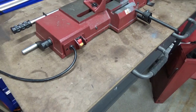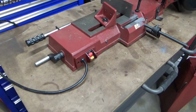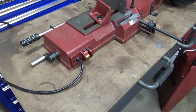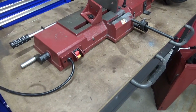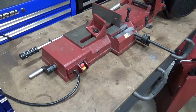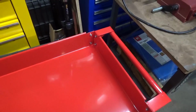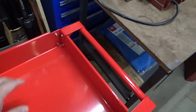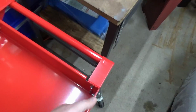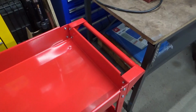I think it would be a bit more secure by bolting it down and compressing the saw against the stops. So with that, I think I'm going to see about measuring and fabricating the mounting brackets out of some 2-inch angle iron, with a couple going across this way, with a couple of supports going down and bolted through the sides. So let's get started.